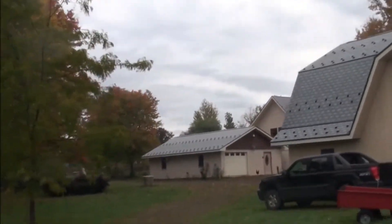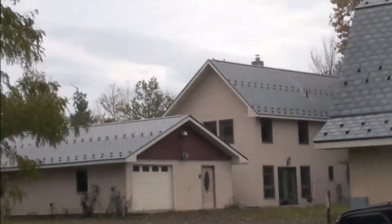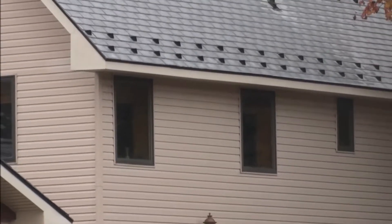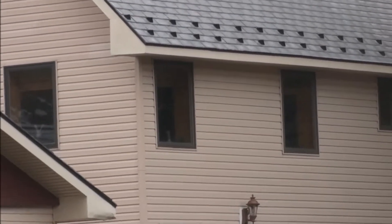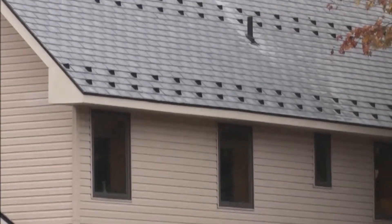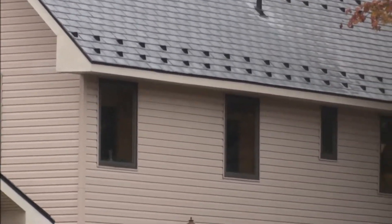Another reason to have a good overhang — as you can see on my house over there, those are all two-foot overhangs. That's a passive solar home. It's not sunny today here in central New York; we get lots of clouds during fall and winter. But that two-foot overhang completely creates a shadow during the summer months over those upper windows, because the sun is so high in the sky. During the winter, when the sun is lower, those windows receive a great deal of radiant energy.